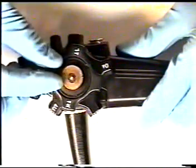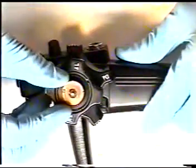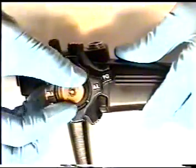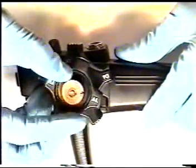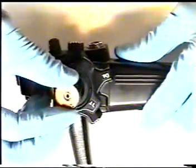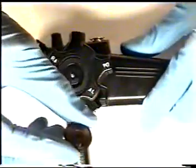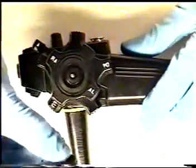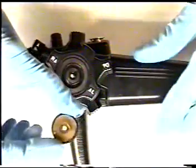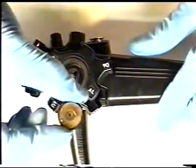The next step is to unscrew the left-right lock assembly counterclockwise. This assembly will only unscrew counterclockwise. Remove this assembly. Be sure to keep it intact. There are many small parts internally. Put this part with the others in sequence.